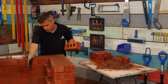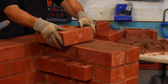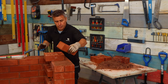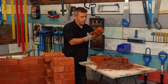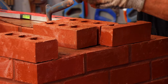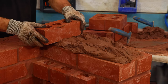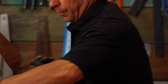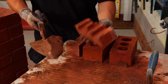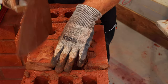Now I've got my first course stepping out and my second course stepping out. I'm going to do a third course, however I'm only going to use two bricks to step out for this one because my grill is a little bit narrower on this top section. A full brick will be along the front here, then I've got two cuts where we've cut the brick lengthways - they're going to be here and another one here - and that's going to keep the bond looking the same on both sides. Now you can bed your third layer of stepping-out bricks on the twelfth course. I'm laying a half cut in here filling in the gaps with mortar - this will be covered by the thirteenth and final course.